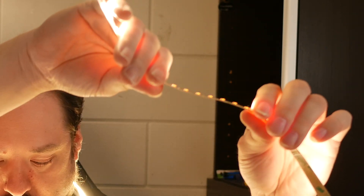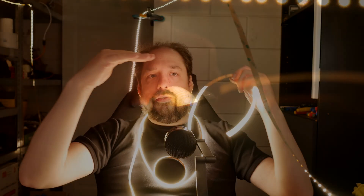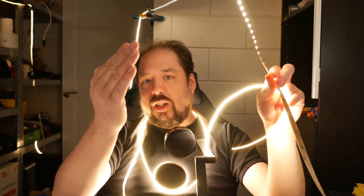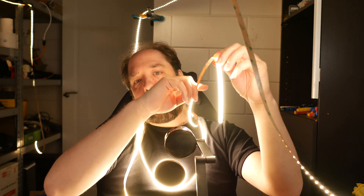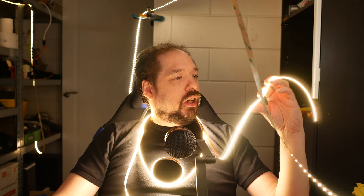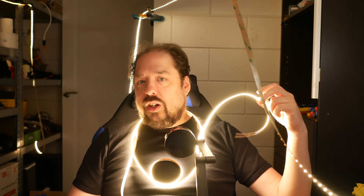One other effect worth noting: a normal LED has a dispersion pattern of around 100–120 degrees, and this officially has the same. But because the COB material sits on top of the LED strip, even if you're not looking at it flat — like looking downward as we do with the bookcase — with a normal strip you wouldn't see the LEDs, but with this one you do see the COB material glowing. That's a different and pretty nice effect that gives a very even glow, and for certain projects it's certainly a good buy.